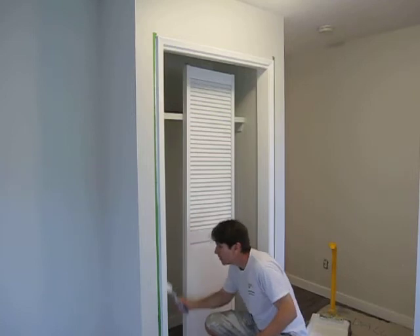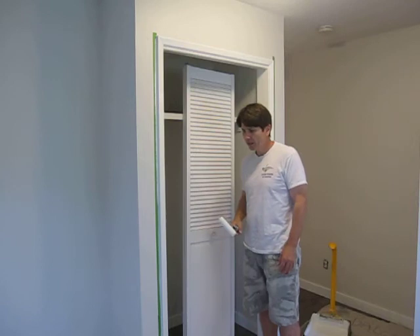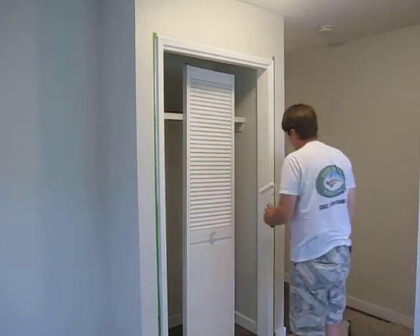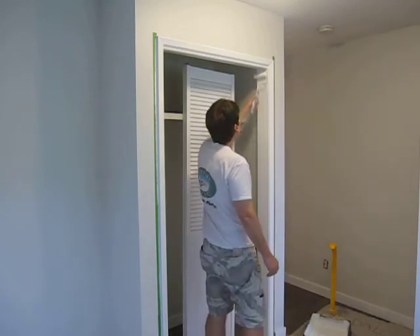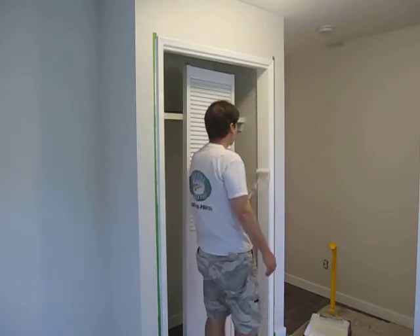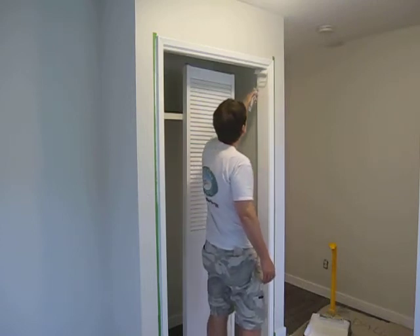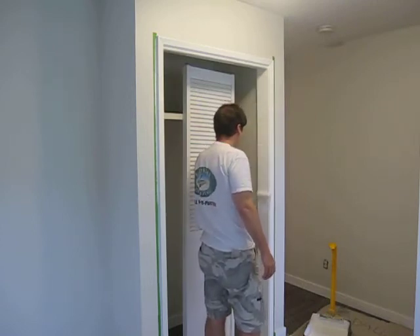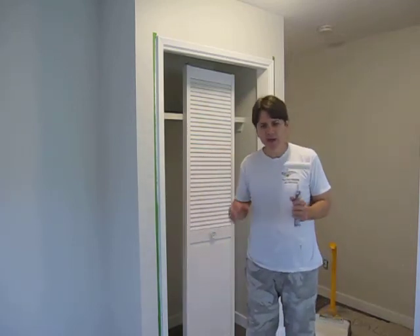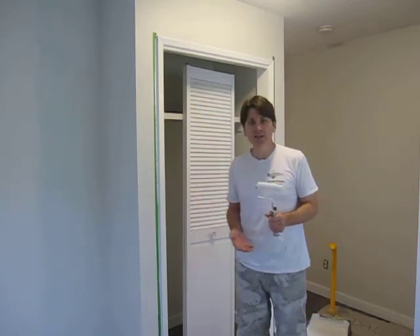In the next video, I'm going to show you how to roll the door with this paint. Normally we spray our doors, but in this case there's no room in here to spray them — it's all brand new floors, we just painted the walls, and we do not want to cover up every room and make it a spray booth. The owner said to roll. In this particular style of door in the bedrooms, they've got a grain to them, so even rolling it you can't see the roller marks — it looks like it's sprayed.